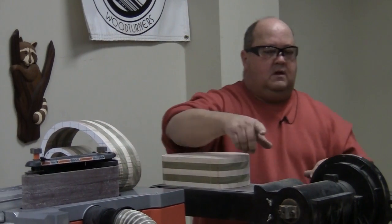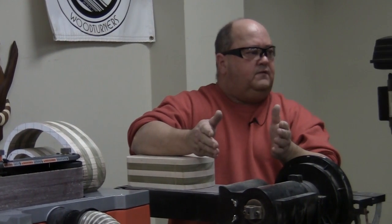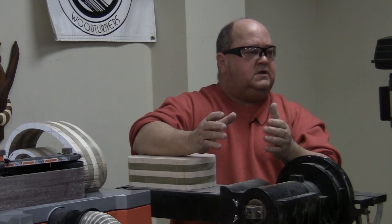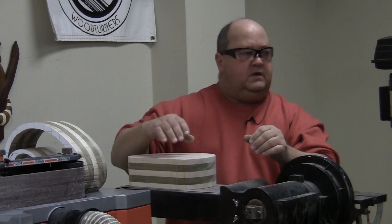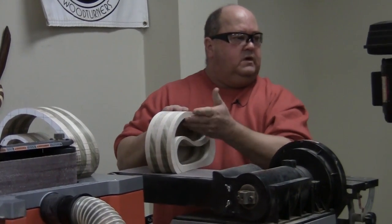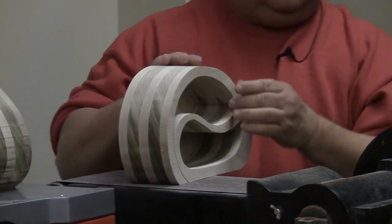When you take the drawers and you cut the front off and the back off, and you take that part of the kerf out, and then you sand it on the outside when you're all done with it, you're taking so much off of it, you're fitting inside the drawer more, and you're not flush. And I'll show you how you handle that in a couple minutes.